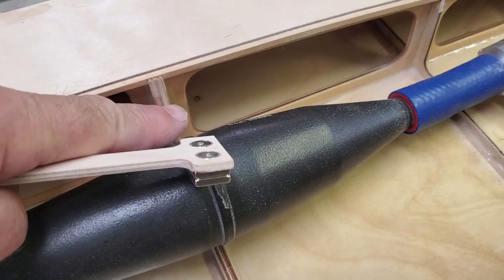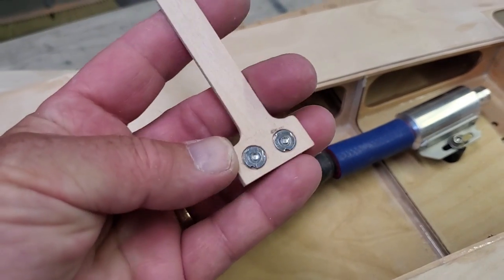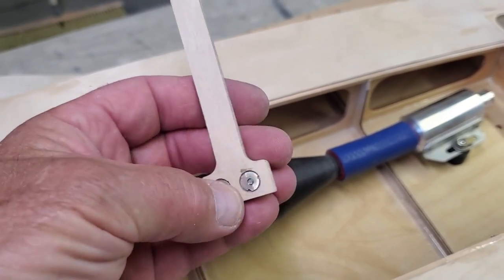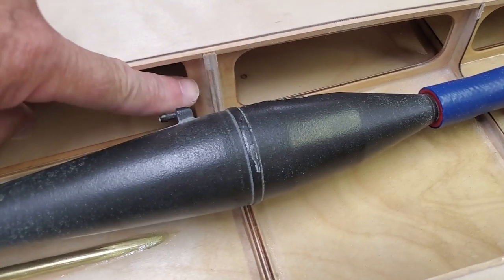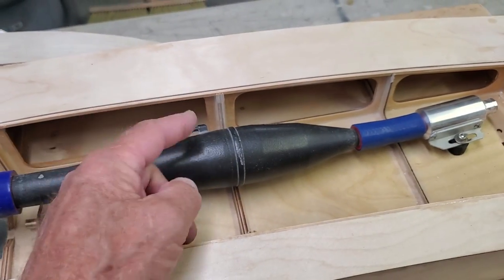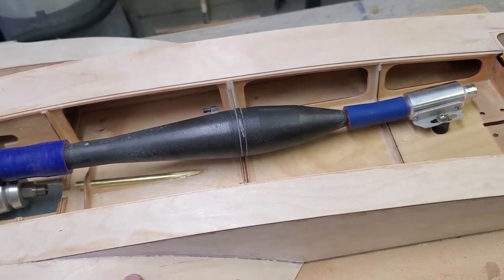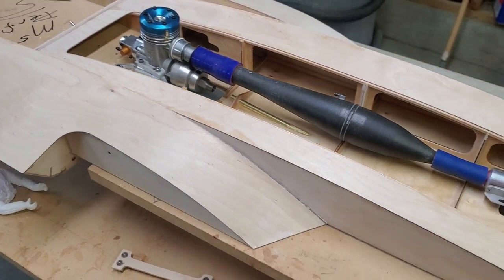That's where we're going to cut a slot in here, 1/8 inch wide, and we'll make another little piece of this super cool 1/8 ply. This one you won't have to recess, of course, and it'll sit all the way back in right here. I know it doesn't make sense. You'll see. I'll make one or two, and then I'll show you how we attach it all and make it all work awesome. Okay, I'll be back in just a minute.